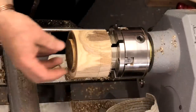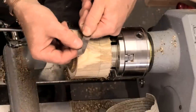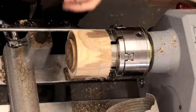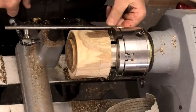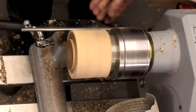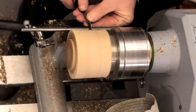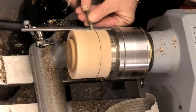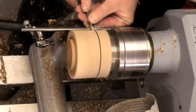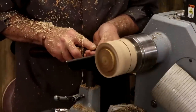Next thing: we're not going to bring the tailstock up — that's going to cause it to bind, start to create lots of heat on the side of the parting tool. So a 1/16th inch parting tool. I can even bring the tool rest over a little bit so I'm working over that center stem. Handle down low and cut on our line — not one continuous cut, my right arm wiggles a little bit side to side, so I'll open the cut out a bit as we're going in.